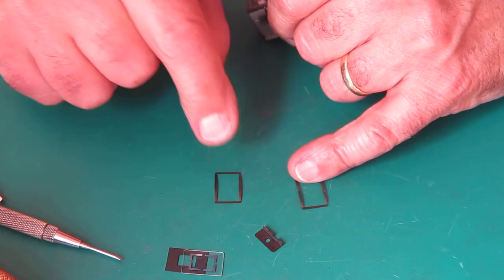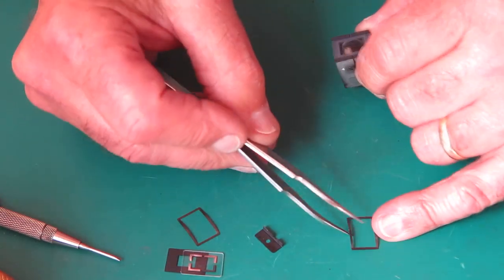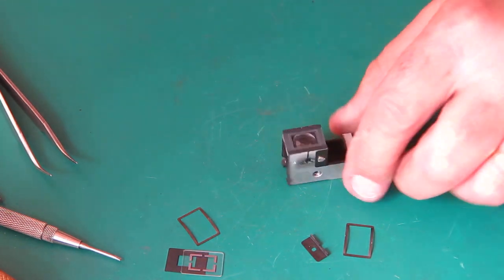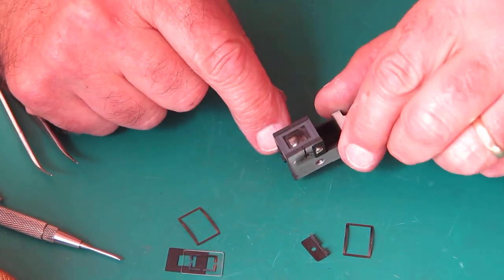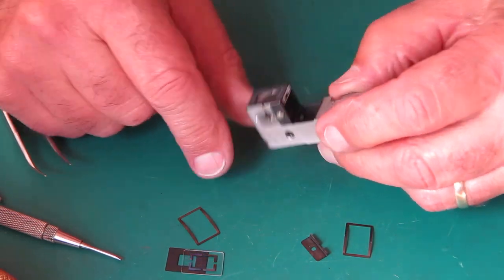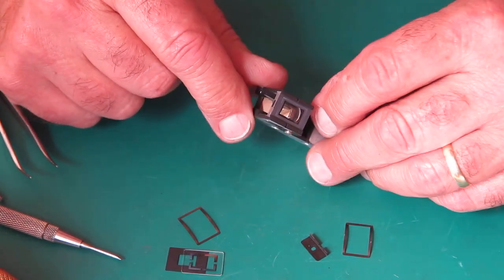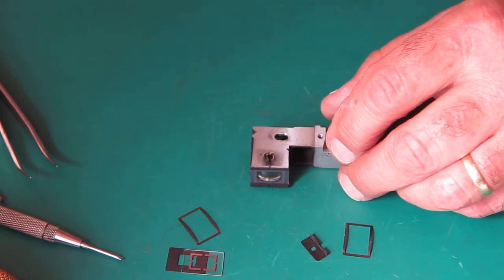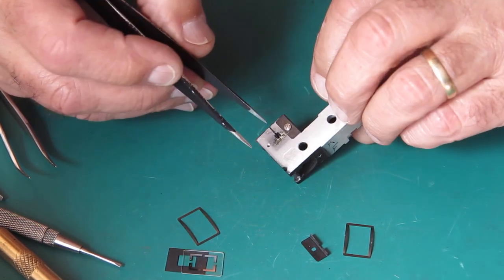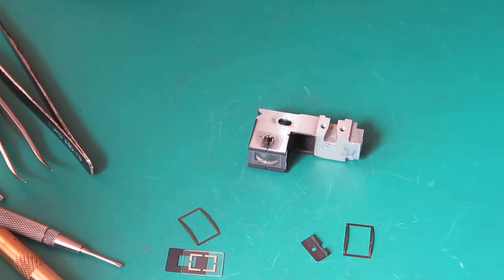This next component has a spring that holds it in position — it's a heavier spring than the other one but basically the same shape. Try not to mix them up. Getting this apart in order to clean it — we've got two pieces of glass, a mask in between them, and a little celluloid mask on the front. We need to get that apart, and it's locked in position with a little dab of lacquer here and here, so I've got to soften that lacquer with some acetone.